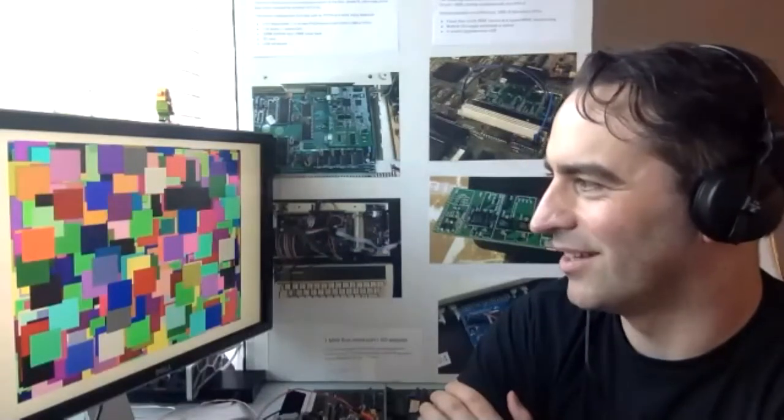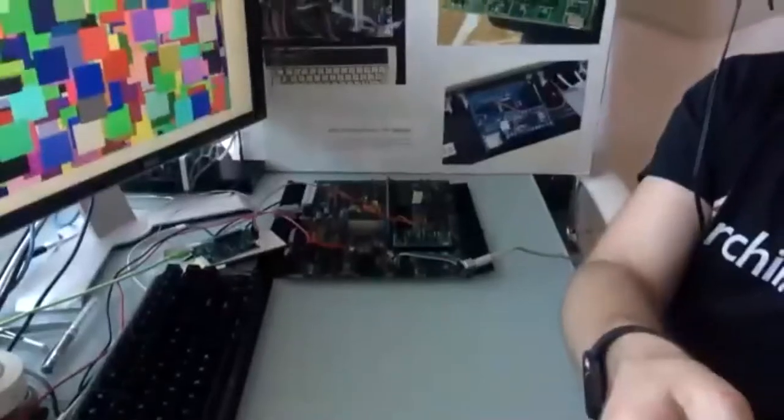You can see on the screen here — this is my memory test code, writing data straight into this A3000's screen memory. Before it can do this, it writes a bunch of words to the VidC control register to set up the screen mode. This doesn't work on a RISC PC or A7000 yet — one of my to-dos is to get that working, if Andy Nightingale doesn't get it done first. The new VidC registers still look pretty similar going from machine to machine, even into the RISC PC — they kept a lot of the design, presumably because they didn't want to re-implement it and didn't have the time. As they say, the Acorn advantage was that they had no money and no people.